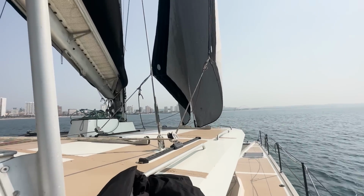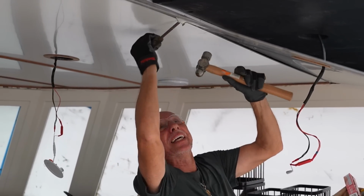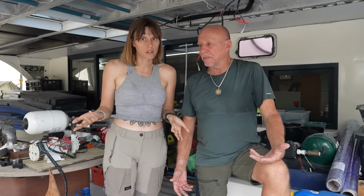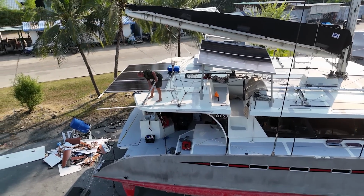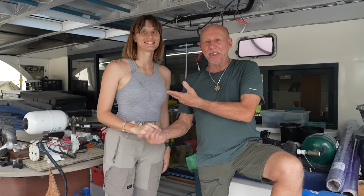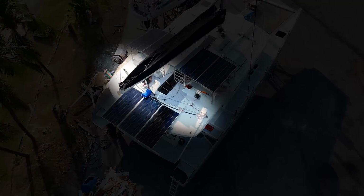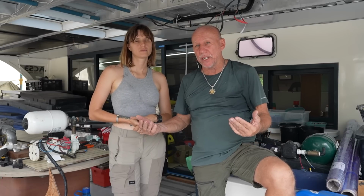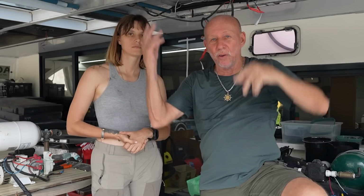We've discovered that this boat was built for speed, so weight is definitely a big factor, and we always have to keep in mind that whatever we add or remove, the balance of that will affect this catamaran's performance. And hopefully by calculation, we take out 10 kilos and we put 5 kilos back of the new materials that are lighter and stronger. You can't add any. I mean, look at the extra weight we're putting on here. Also found out that there's a problem with the positioning of the traveler for the mainsail, and the only way to move the traveler further to the front of the boat was to gain access to it all, and now we have that ability.